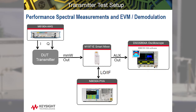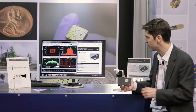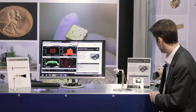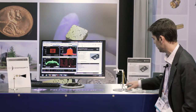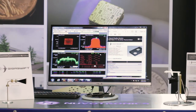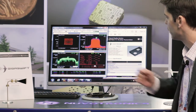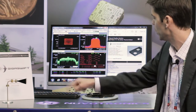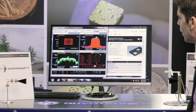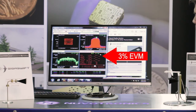I'll show you the radio operating. Here is live the E-band radio — a very compact high power E-band radio. The E-band radio is located here on this platform. We are entering with IQ and a 10 megahertz clock comes in and just one cable for the power. We are transmitting 64-QAM over 800 megahertz bandwidth. You can see here the constellation of the signal and we are demodulating that with the oscilloscope and looking at the performance. You can see about 3% EVM — that is the performance of the radio.